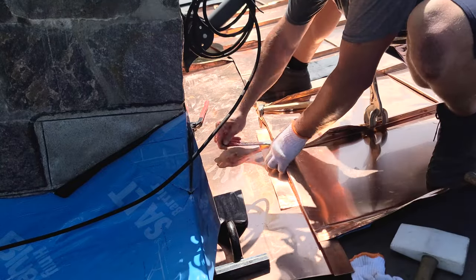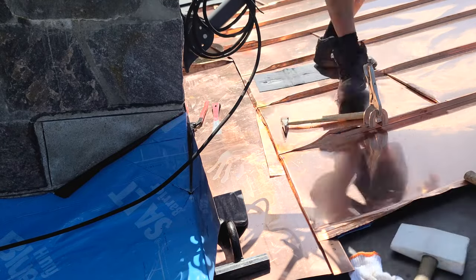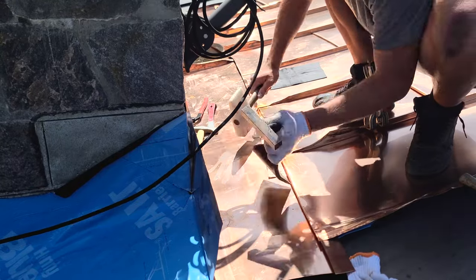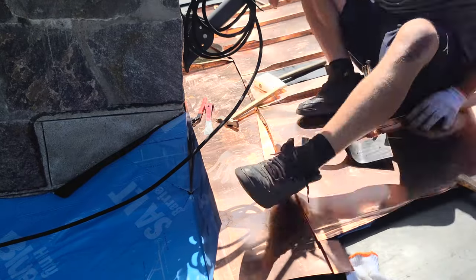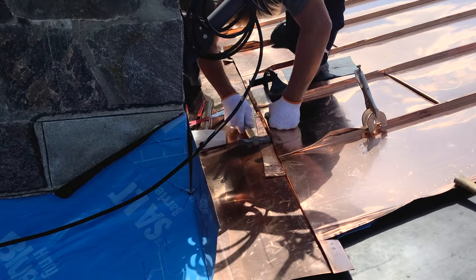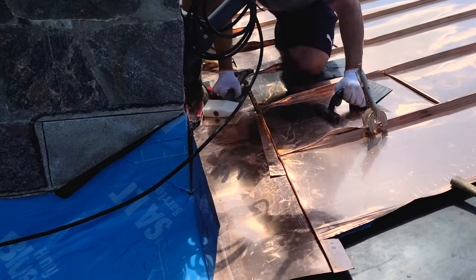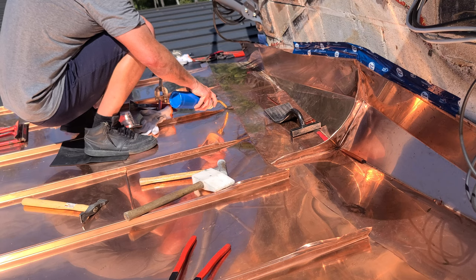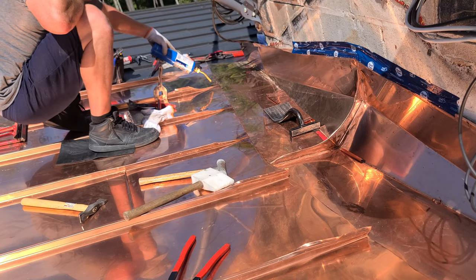For the first turn of the valley hook, I have a seaming hammer — it has a horizontal head and a vertical head; I really suggest you buy one, very handy to have. I'm pushing that lip down underneath the valley hook. You can see at the bottom of the screen I have an exaggerated-sized valley hook, because we're going to be folding this under once and then folding it under a second time. So you basically have a double-folded flat lock turned over twice on itself for a low-slope waterproof detail.